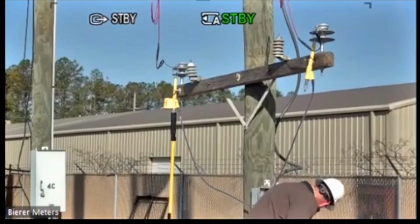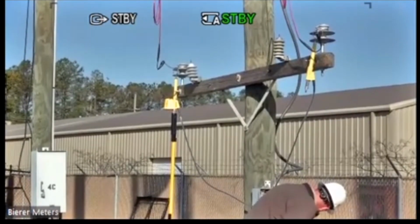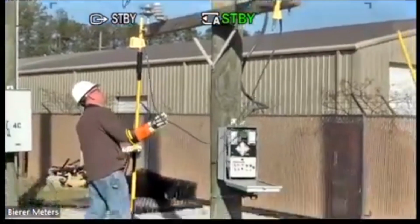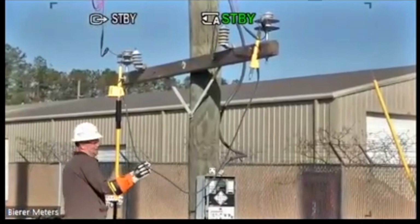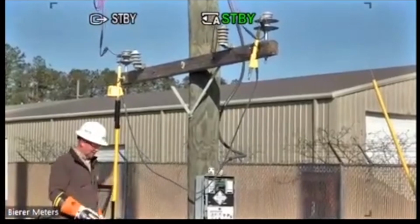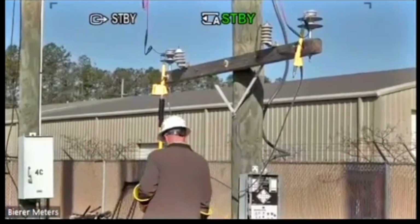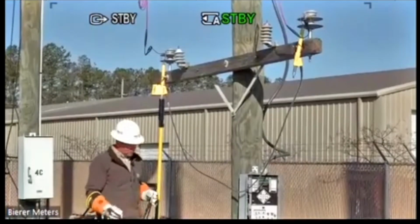So if I take this device and I raise it a step, I want to see what the difference of potential goes to. And it goes to 70 volts, 75 volts. Okay. So there is the in step, out of step. I'm verifying that the light in this regulator, the display, the neutral light in this Cooper controller is actually correct. So I want to make sure that light is correct, or the dial.